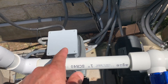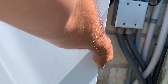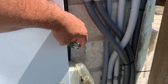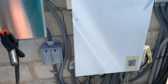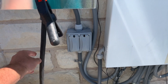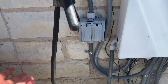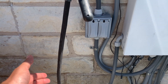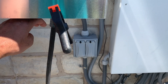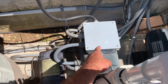This time I'm using a different inverter to run the pump. I removed the display and installed a junction box, so in the morning this Blue Heaven box is going to turn on automatically at 8 o'clock, give power to this junction box, and that cable — gauge 12, five wires — is bringing the power. Two of those wires bring the power up to the inverter and three of them bring it back from the inverter to the pump, all connected inside this junction box.